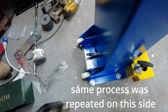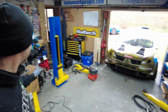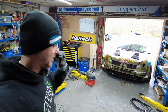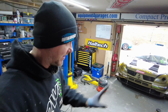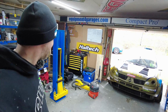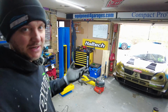Now that both of them are fitted, I'm very happy how they got fitted. In fact, yes, the concrete is definitely at least 125, because I drilled 120 and it did not touch the bottom. So I know that it's strong. The anchor is actually hammered in really nice and tight, and I'm able to torque them to 60 Newton meters, maybe even more. Doesn't really matter that much.